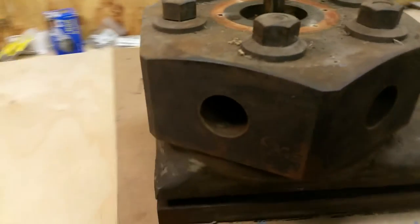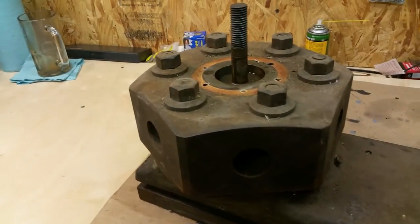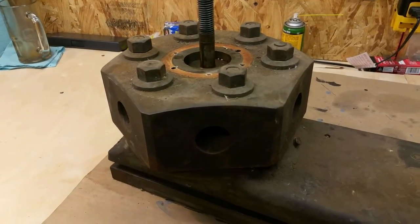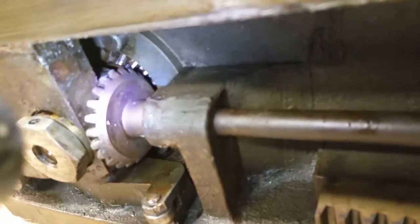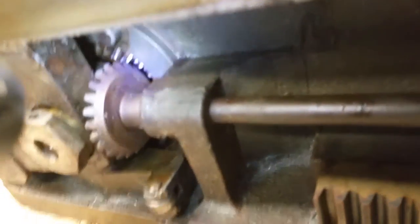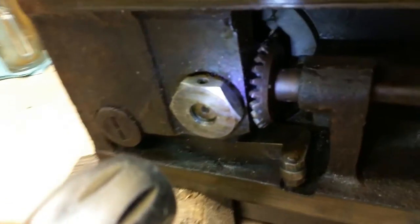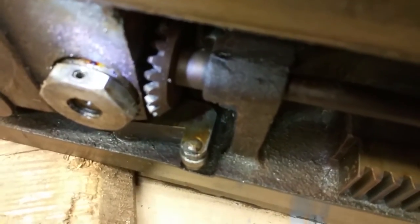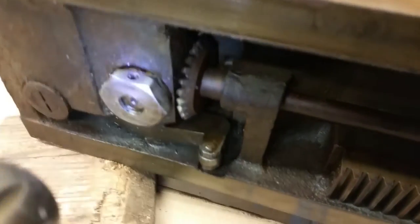We pulled our two attachments out of the turret also. This has some play if we start lifting it up, but it feels like we're held by something underneath, so we're going to roll it over and have a look. Looking at the bottom side, it looks like there's a pinion gear of some type — something like you might find in a differential. I suspect this nut here is holding the bottom shaft. There's an allen set screw holding that nut onto the shaft, so we're going to remove those and see if we can lift the turret off.